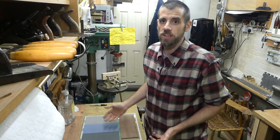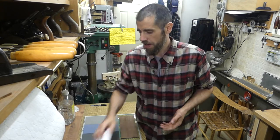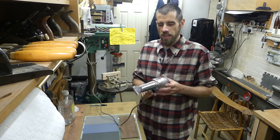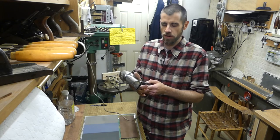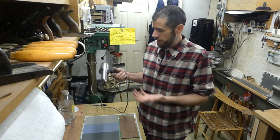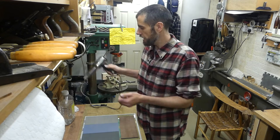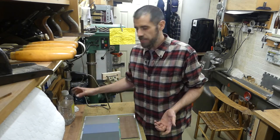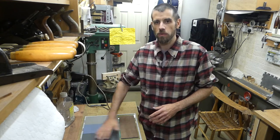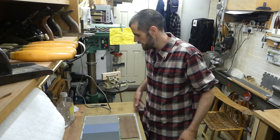When it comes to changing the abrasive — which you'll need to do fairly regularly — I've found two quick ways. First is with a heat gun: I heat the area and it softens the adhesive so I can peel it off, and usually the residue comes off with the paper. If there are any issues I use standard white spirit to clean off any residue — you can soak a rag with white spirit and soak the top of the paper, wait for it to soak through and loosen the adhesive, then it peels off dead easy. Then go back to degreasing with brake and clutch cleaner or an alcohol.